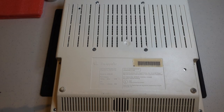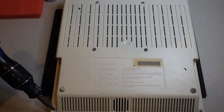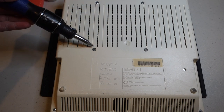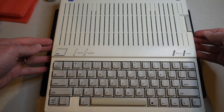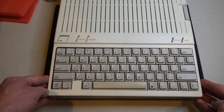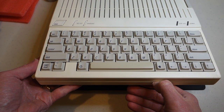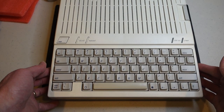As you may recall from some of my earlier videos, there are six screws we have to take out to pop off the case — here, here, back here, back here, and then on the other side. You don't have to take out the four screws here because those hold on the disk drive and we're not going to take that out. Once you've got the six screws out we can just pop the case off. Easiest way is to work from the front — there's a little tab here which if you use a credit card you should just be able to slide it along and pop the tab, and then you can just pull it off from the back.